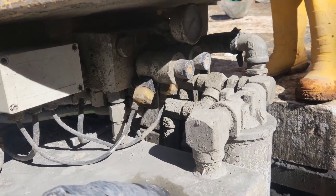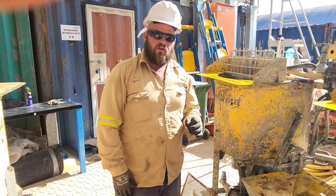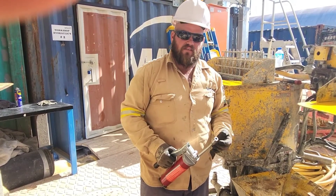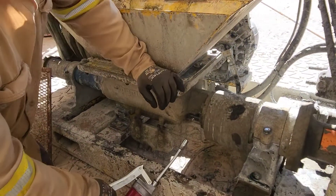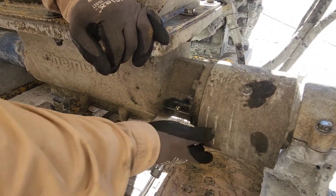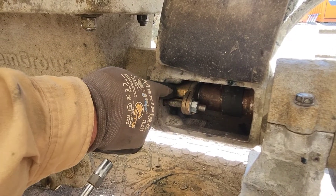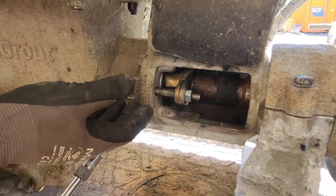I just wanted to make a short video to show something that has to happen every single day when we're grouting. This needs to happen at the beginning of a shift before we start grouting, if we shut down at lunch, and if we don't shut down at lunch it needs to be greased still, and at the end of every shift when you're done cleaning out. On all the grout machines, there's a greaser on either side of this housing that has to be greased. Inside of here is a grease packer — this is pushing in on a rubber gasket that holds a grease seal. If it doesn't happen, the concrete will start migrating back towards the shaft, causing damage and giving way more resistance than the shaft can handle, causing it not to spin.